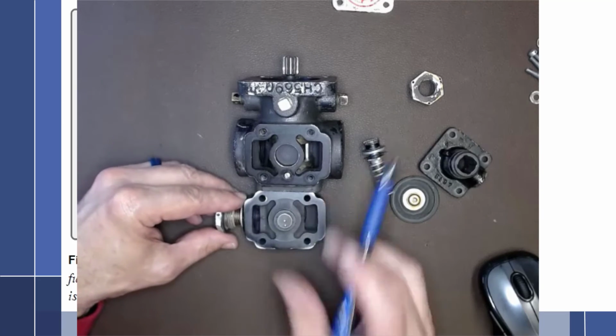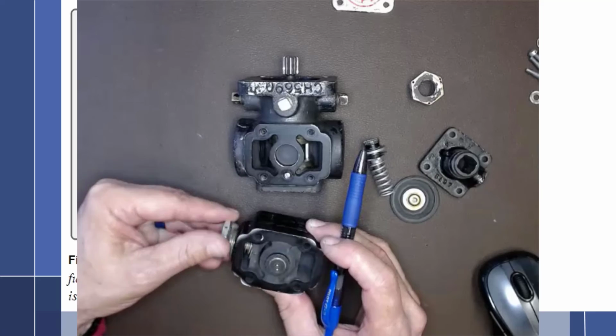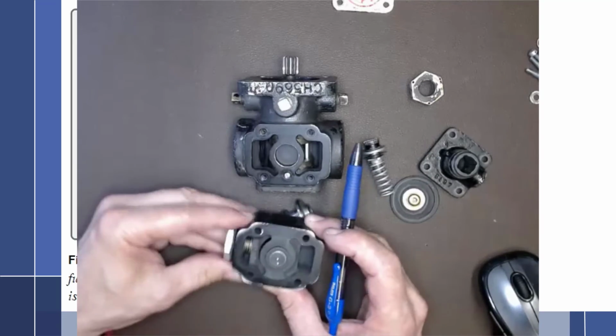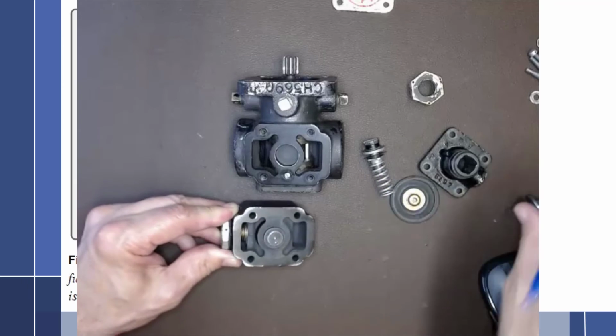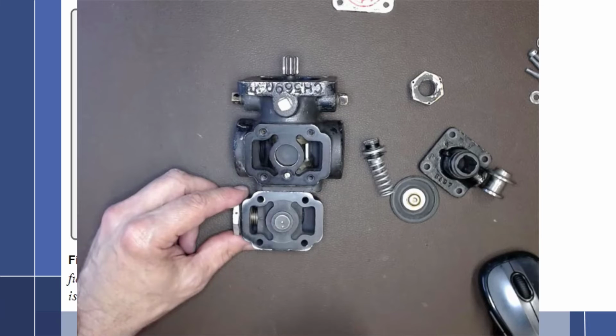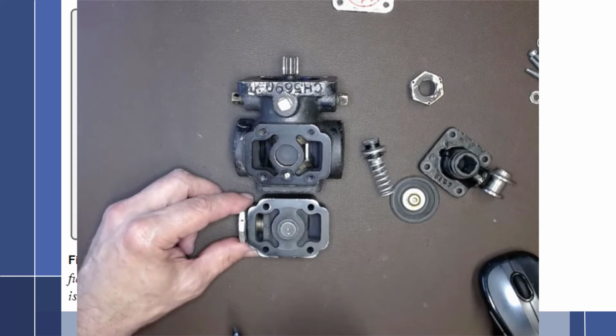So once this pump outlet pressure exceeds the boost pump, then it's going to close this little valve off inside of there, and the boost pump will no longer be able to bypass this bypass valve right there. So that's a bypass valve. Remember, it's there for two reasons. One, to start the engine, and two, in case this pump should fail.